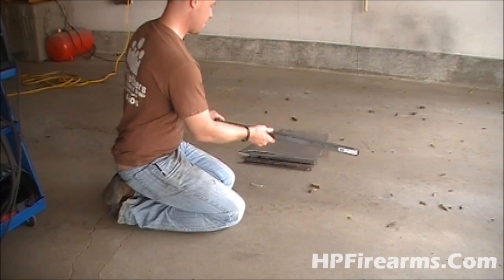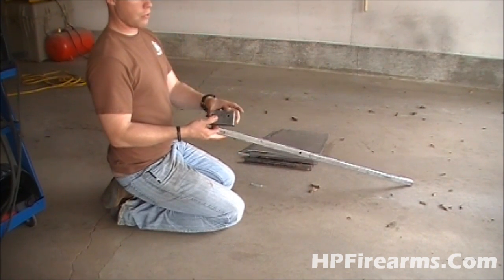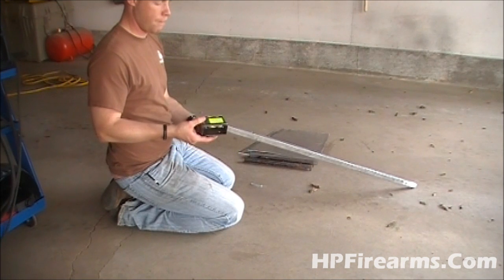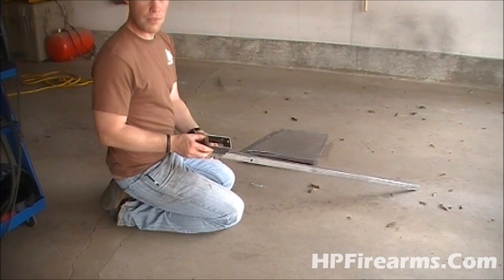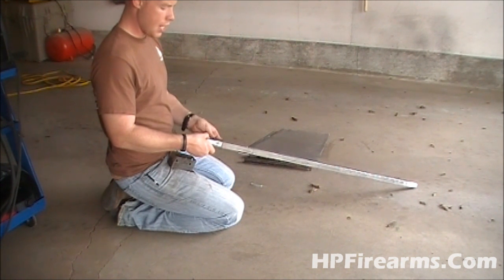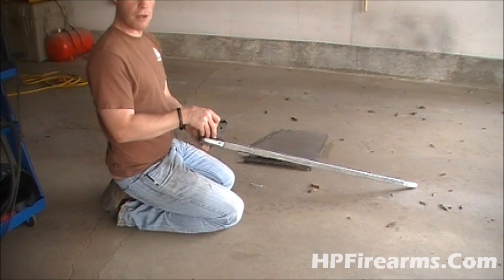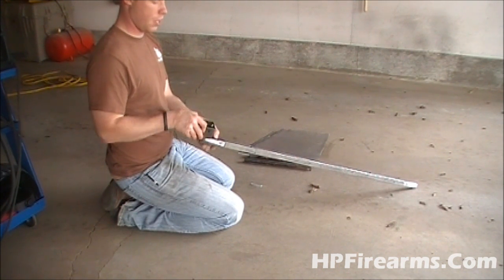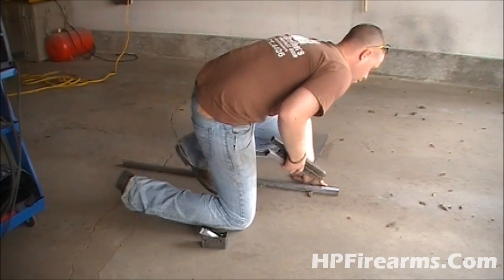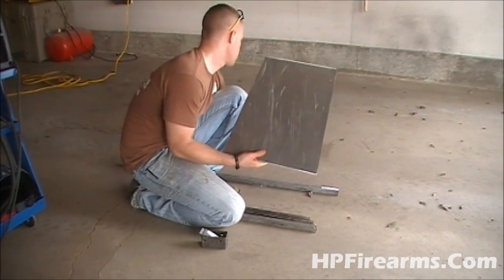This is going to be the back where the fin goes, and I've already cut the pieces for back there. On the front here, this is my mount for my motor — for the generator I'm going to be using. We'll go over the motor and electrical components in the next video. It's a little bit wider than the actual tubing itself, so I've taken a couple of short pieces of angle iron and I'm going to butt these up and tack them right to the top of the tube. That way I can get my motor mount a flush place to mount and weld to. On the back, I've gone ahead and cut the framework and the panels for our directional fin.